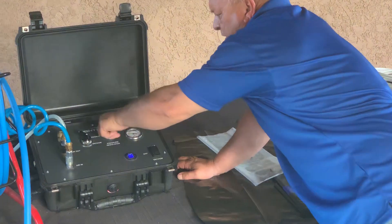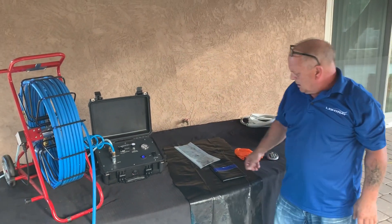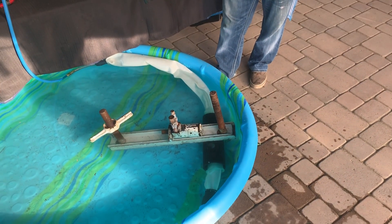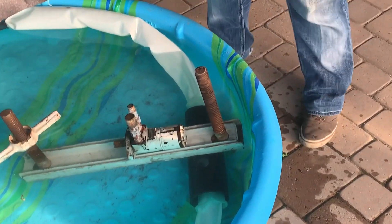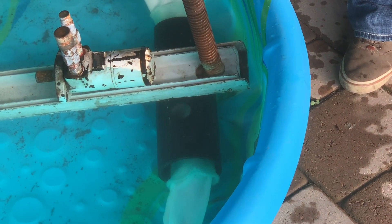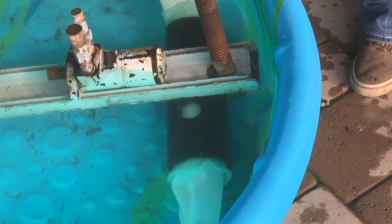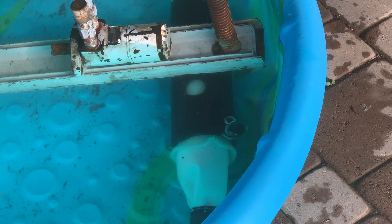So we'll drop the vacuum and switch over to pressure. We'll let it pressurize up slowly for about a minute at about one to two psi. This will inflate slowly, displace the water out of the pipe between the liner and the pipe, displace any water that's between the packer and the liner, and expand and push it up tight. We've already proven prior to this that the packer needs around five or six psi to be fully expanded in a four-inch plastic pipe. So after about a minute, we'll take the pressure up to two to three psi.